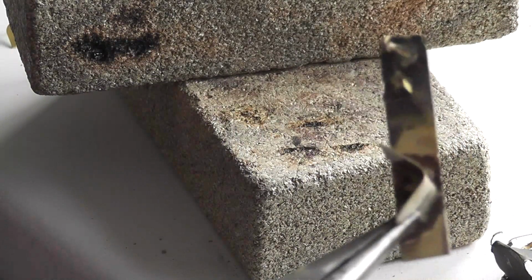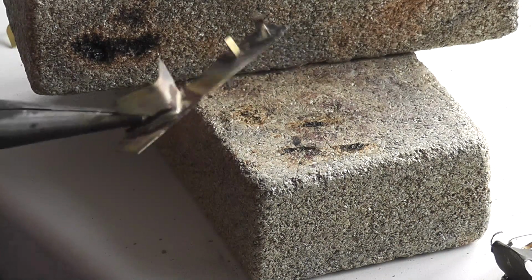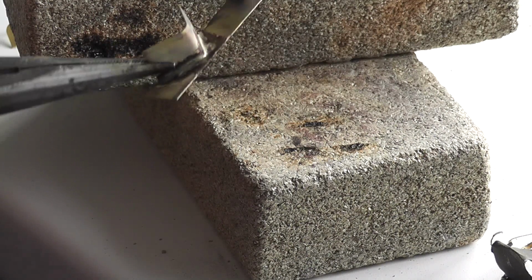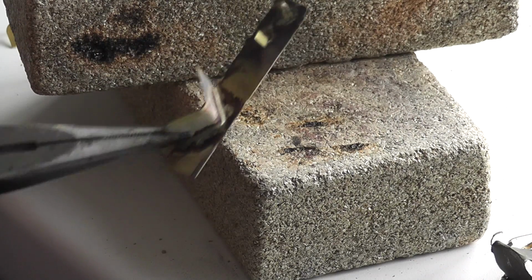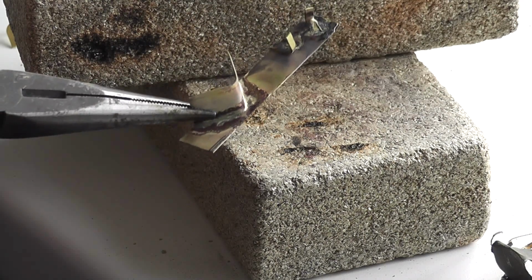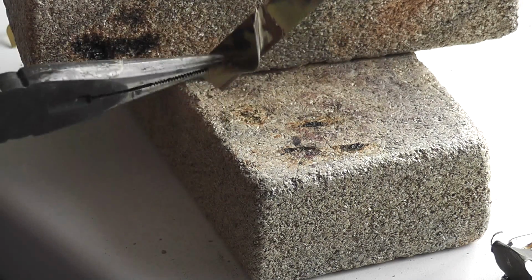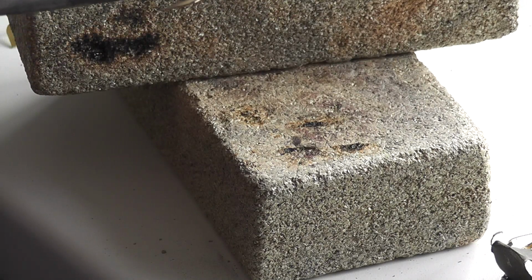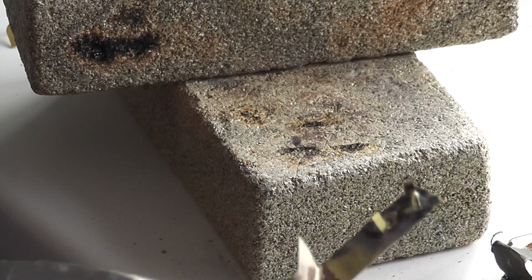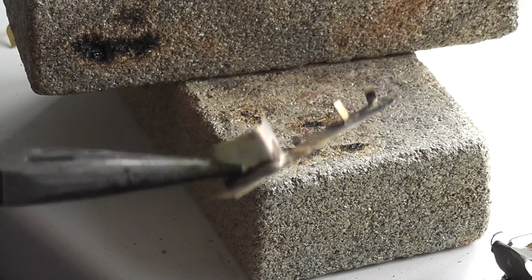It just needs the silver solder pushing in properly so it sticks to it, and then the torch doesn't blow it away, and even screwed right down so you've got a minuscule flame, it provides lots of lovely heat and no apparent risk of burning the object you're soldering away.